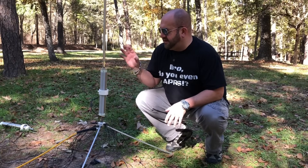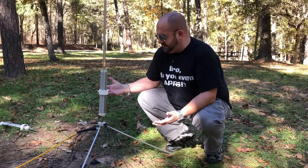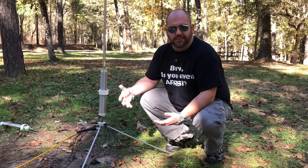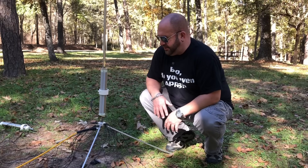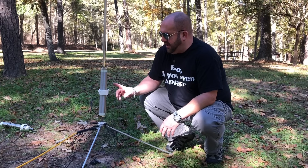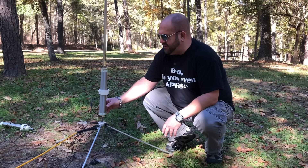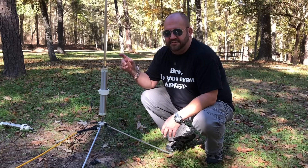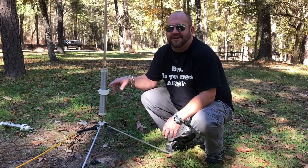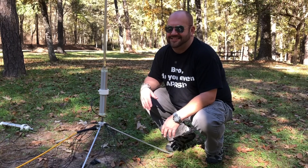As a control, I set up the Silver Bullet Platinum with the 17-foot whip and wanted to see where it was going to be on the SWR scale. We're about 1.3:1, pretty much right in the middle of the band, and bandwidth isn't terrible. We're not going to get the entire band, but pretty wide enough for just the phone portion or the lower digital CW portion. So I'm going to put this coil way down and then add the other coil — use this one for inductance — and see how much of the tap we'll have to use on the other Silver Bullet 1000, and see what happens to the bandwidth, if it'll tune up, and how high the Q is.